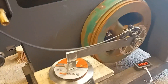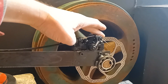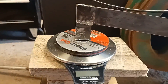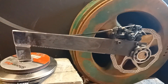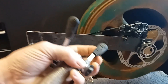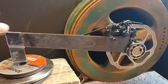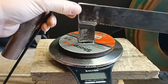You might notice a few little changes. The first thing you'll notice is a mountain bike disc brake that's now attached to it. This is here to measure torque. This lever is one foot long and the scale can be set to pounds, so what we're measuring here is pound-feet. I've got this gear changer from a push bike, which applies pressure to the disc brake, locking it up. All that force is then transmitted to the scales so we can measure pound-feet.